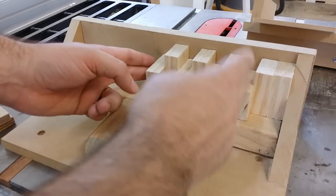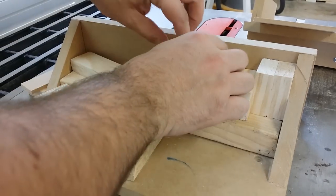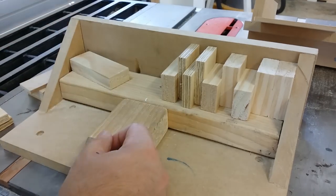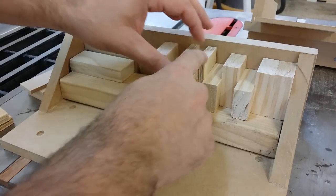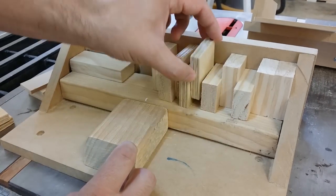Here's a standard template that's just got three quarter inch fingers all the way along. What I'm going to do is take out these ones and replace them with half inch fingers. One thing that was pointed out to me is you don't need to cut two heights of these blocks - you can just cut one and then lie them on the side, so that's what I do now. Makes things a little bit easier.